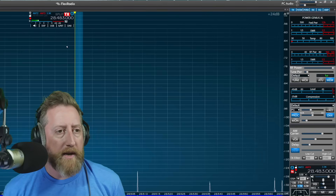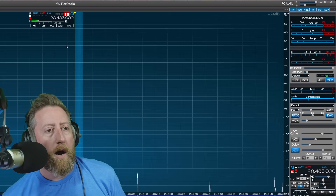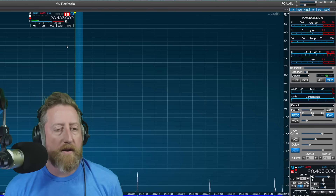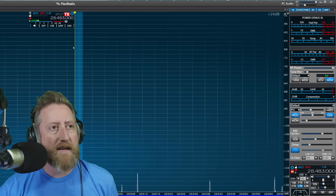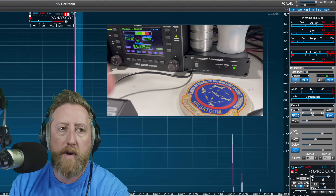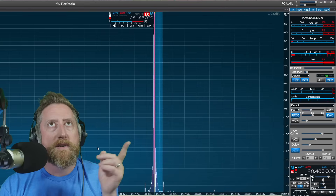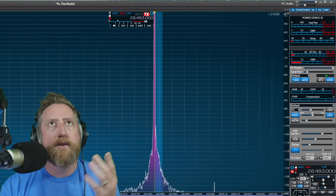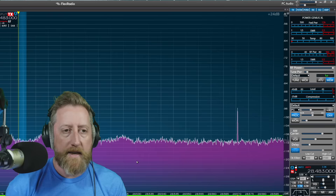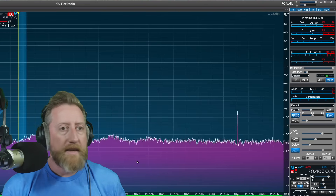So we switched over to 10 meters. If you want to tune this radio up, you've got to give it a little bit of power — between 10 and 15 watts. You could use a CW key like a straight key, or on an ICOM you could hit the tune button. It could be RTTY, it could be AM with a constant carrier. You can see some weird spiky bits there, but if I hit the tune button in the upper right-hand corner, I've got a 3-plus mismatch. I'll click the tune button on the tuner and we'll watch that red line drop down — and then it's done. There's your completed tune cycle. Now we have a match. The impedance is all lined up, so you can transmit all the way down that line without as much power line loss, getting your amplified signal to the rest of the antenna wire.